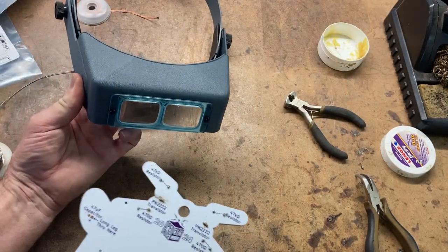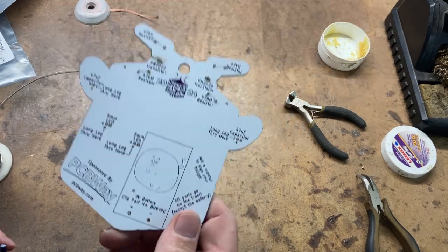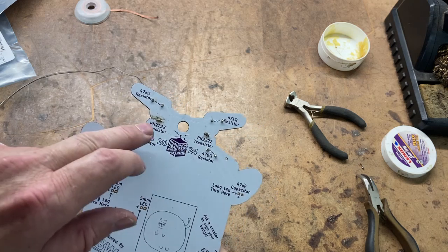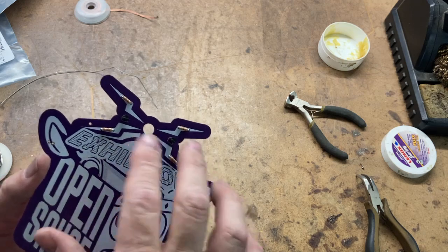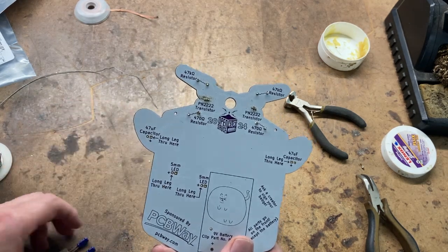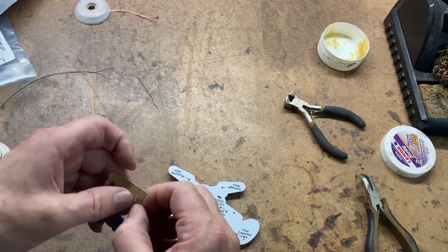Maybe not pretty, but the leads are started in place. A pair of magnifying goggles sure helps to look at those to make sure they are separate — and they are in fact separate now. The next components are going to be the capacitors and the LEDs. The resistors are not polarized — they can go either way. The transistors you follow the outline, so they definitely go in one direction but are easy enough to figure out.